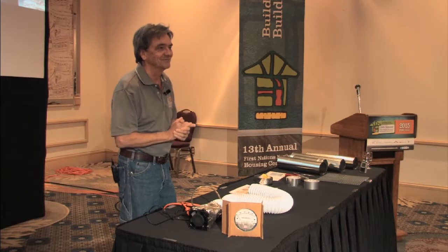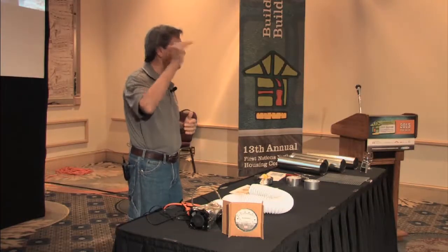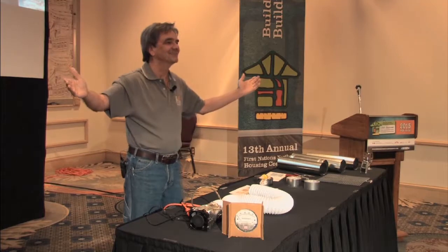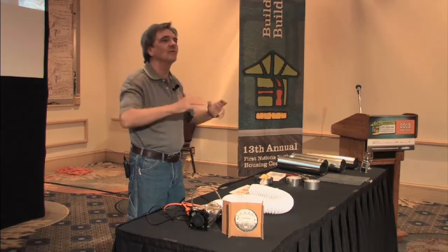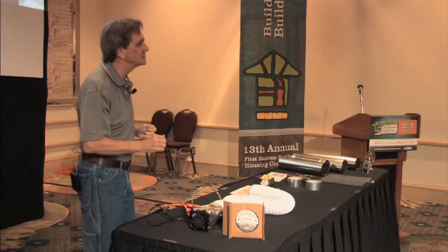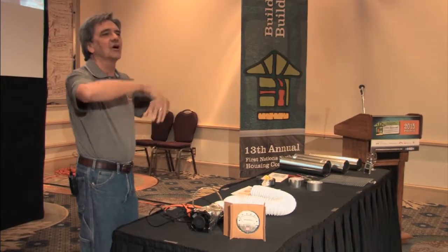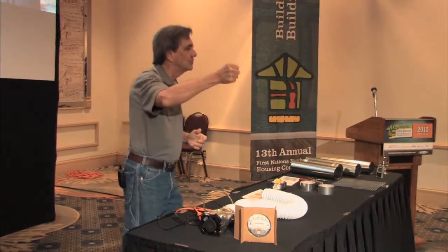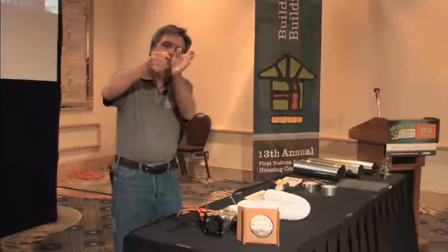You just got it. And in fact, I'll go over it one more time, because if you actually tell the residents, particularly in your rental housing, drive it home instead of long spiels. You just say, if the beer mug is cold and it's humid in the summer, there's water on the outside of the mug. It just collects. And the same thing in the house. You have a cold surface, high humidity, you get water.